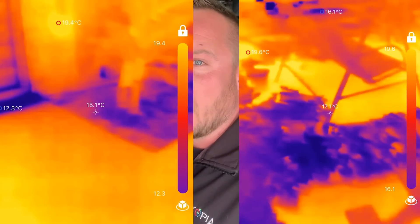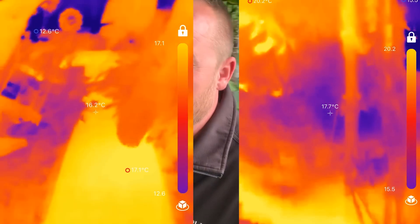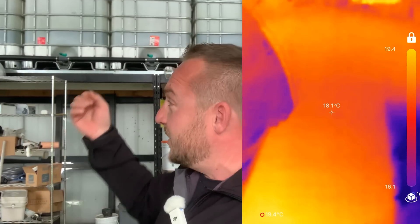I checked my concrete in the cold morning. I brought the thermal imager in and the concrete is radiating heat back compared to everything else in the greenhouse — heating up by day and radiating back at night. My water storage tanks are not hit by direct sunlight; it's just the ambient heat warming them up. On a cold morning you can see the temperature and they're radiating heat back at night. I tested my fish tank as well — that's just like a water tank, and it's radiating heat back at night too.